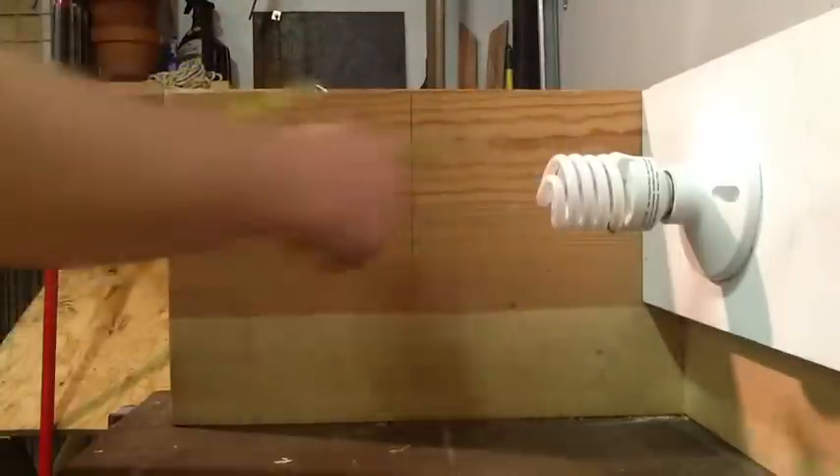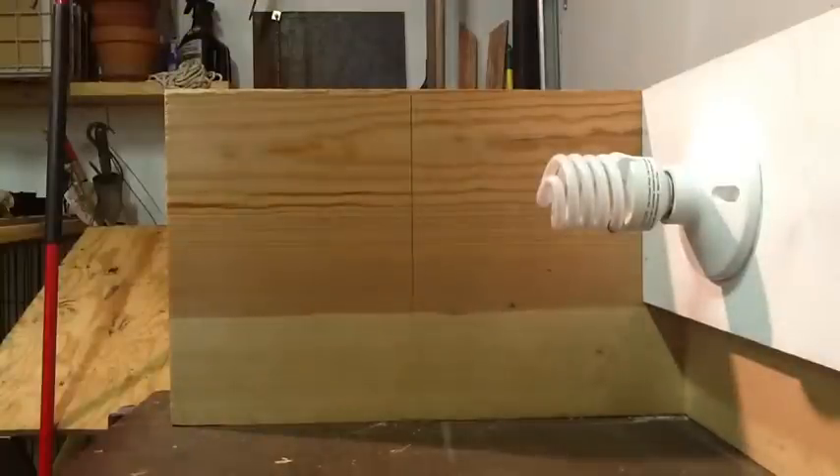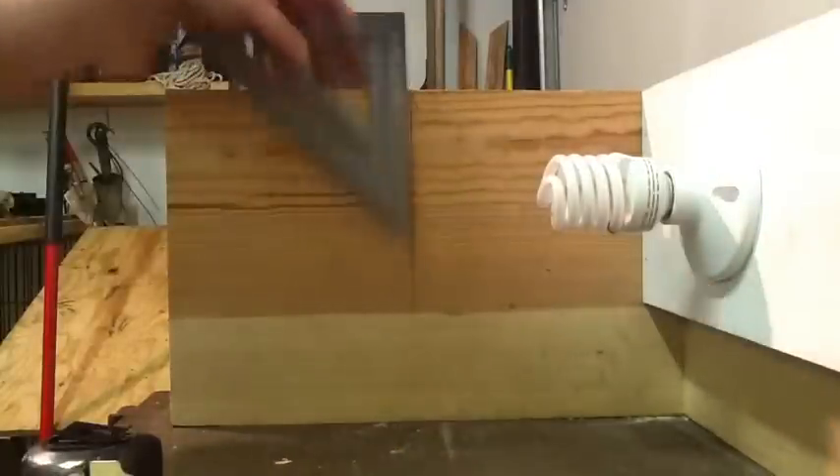So I'm going to leave some space — you don't want the board right up against the bulbs. About five inches from here, I'm going to measure it out and leave about eight inches, so that will give me about a three-inch gap from the bulb. I got my screw there and drew me a line.